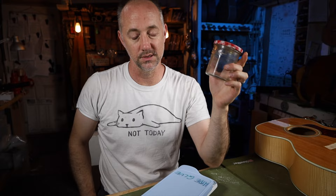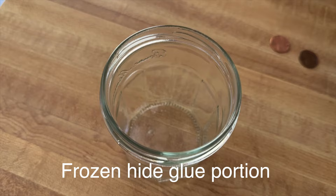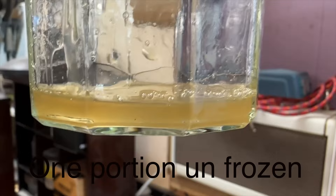For storage: once you've liquefied and mixed the hide glue, you can keep it in the jar in the fridge — it keeps really well, just watch out for mold. Another method, first mentioned by Frank Ford, is using an ice cube tray. Instead of heating up an entire batch, you pop out a small segment of hide glue, heat that up, and you're ready to go. Thank you for watching — I hope this took the mystery out of hide glue. Please like, subscribe, and leave a comment, as that really does help the algorithm.